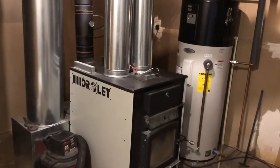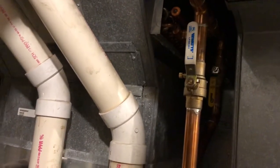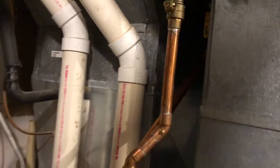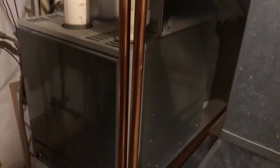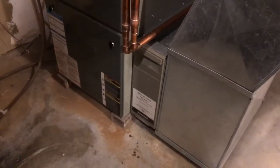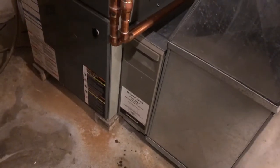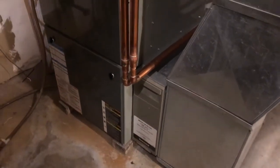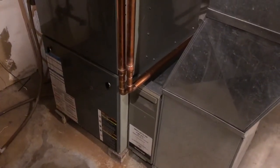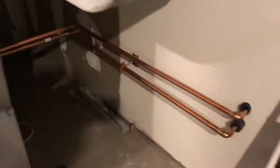I don't get a lot from the propane furnace even though I've got the hot water coil up here to deliver heat from the wood boiler — that's a 24 by 24 coil. I don't have a lot of supply registers in the basement, so I opted to add another heat emitter. You may have noticed in one of my other videos I had a second fan coil installed in that filter box — I removed that. I discovered that one 24 by 24 fan coil is more than enough for that furnace; the second one wasn't really gaining anything. So I ran three-quarter inch piping to a new unit.